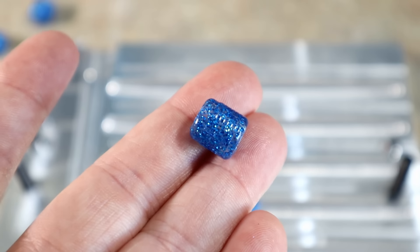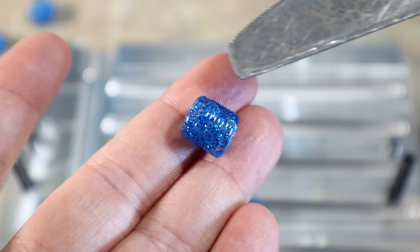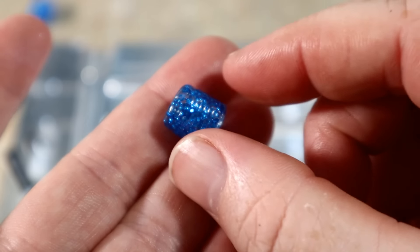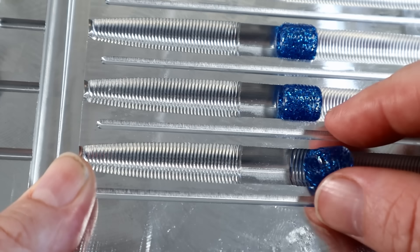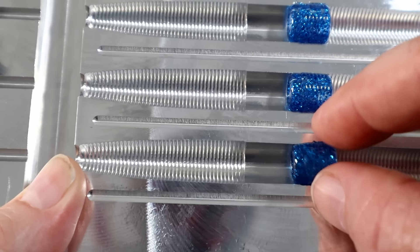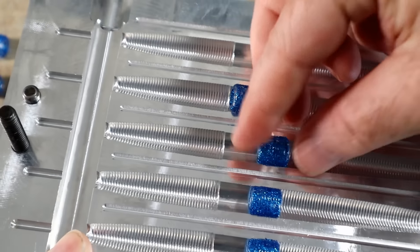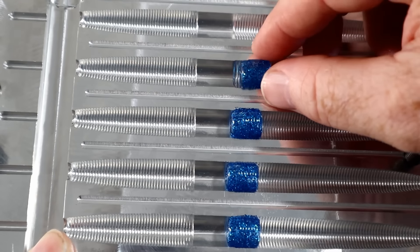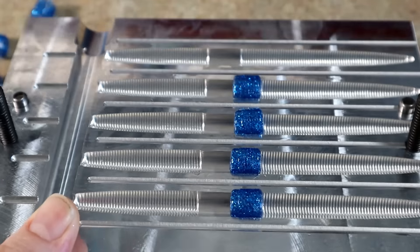Here's where we actually have to pay attention. If you look, it's not perfectly round — you can see this little notch where the bait goes from thick and then tapers in slightly. That is the key tip, and the way it goes into your mold: you want to line that little notch up right at the edge of the egg sack. You're not putting them in the egg sack, and you're not putting them behind it — just right there at the edge, exactly like that.